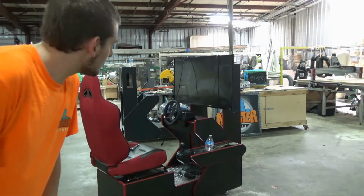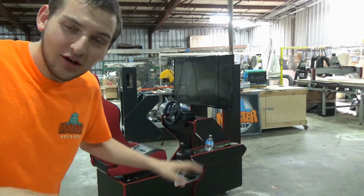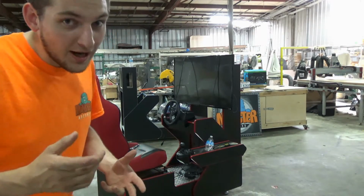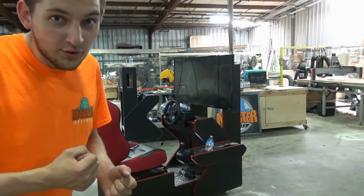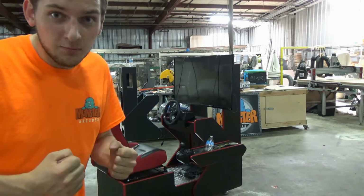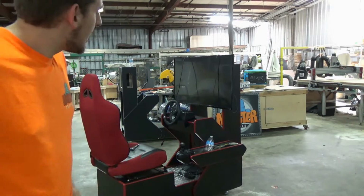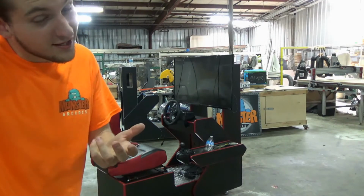Alrighty, so we've gone ahead and gotten our wheel mounted. A quick thing to note, the arcade cabinet itself is made of 3/4 inch birch plywood, very heavy duty. The race systems themselves are made of plastic, also pretty heavy duty, but you, a human being, are much stronger than they are. If you over torque those bolts, they will break something. So once you start feeling a bit of resistance, give it a shake. If it feels solid, it probably is. Also remember that you've got not just those bolts at the back, but the compression at the front from the twisty bits. So just keep in mind that you don't want to break anything, making sure it's never going to move, because if you kill the threads, it will move.